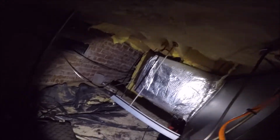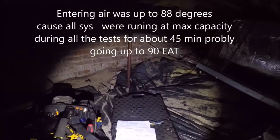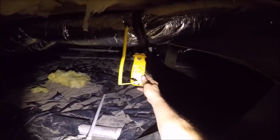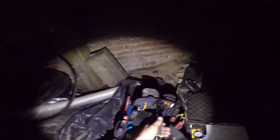And this one, see if we got a high head on that, which is probably because it's very hot in the house. I wouldn't want to take any charge out, but we got 107 degree air coming out of our vent here. 450 head, and there might be something wrong with the expansion valve in this, but we may have a dirty coil. And that coil is clean as a whistle.